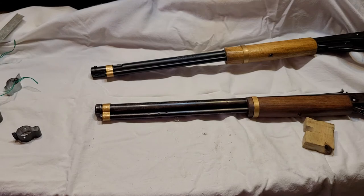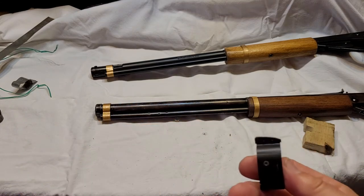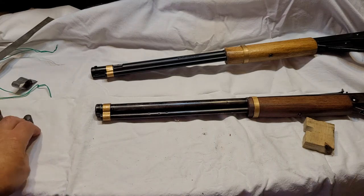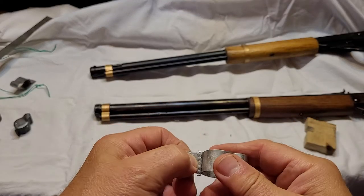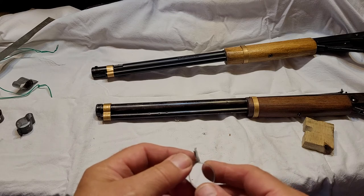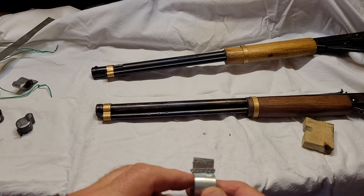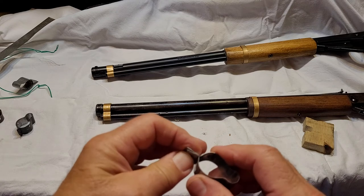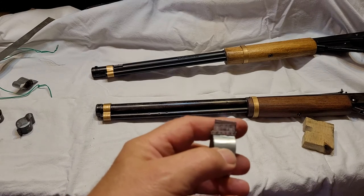Once you have this in place, you're wondering how you're going to keep it together. I've done it several different ways — I kind of like this way because it's more solid, but you can use silver solder. You can grind out to bare steel the inside edges and solder it down, or you can tack weld it if you have a tack welder. What I do — and it's easy to see on this one since I haven't painted it — I take a thin piece of the steel and crimp it around the two pieces of band, and that holds it tightly in place. I crimp it using my bench vise, which has good star jaws that crimp these things in tightly.